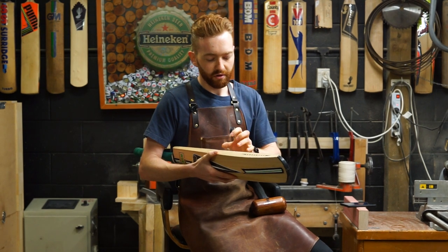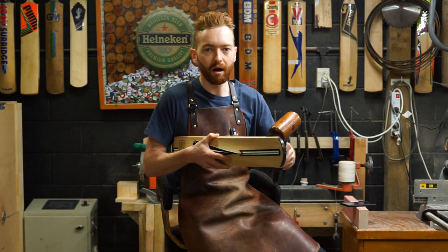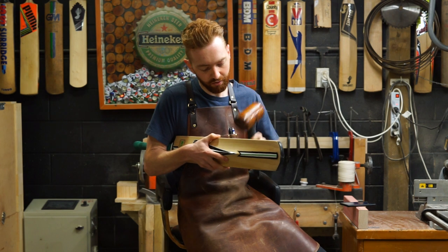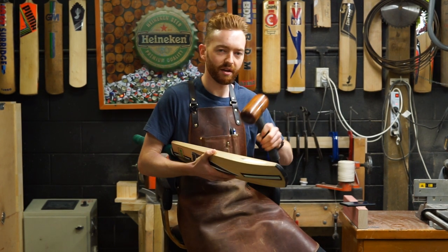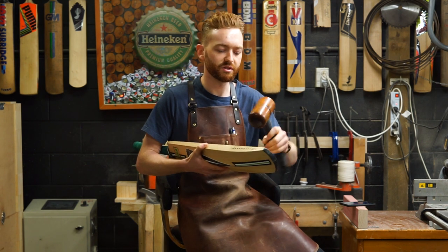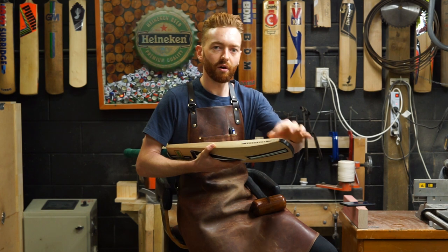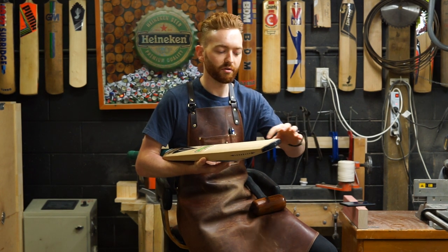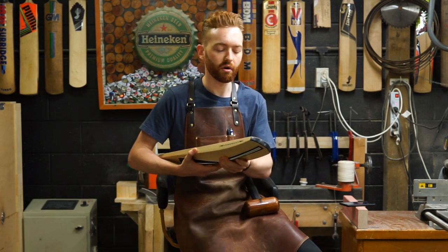You may also notice that I go on one angle — I go a little bit higher, and then I work back across the face to kind of even that up. So I'm going high through that area, and then I come back across the face. You continue to do that as those edges slowly round off. Once you've done 15 minutes on that edge, you then repeat that process on the other edge, and then we would move on to working on the toe.